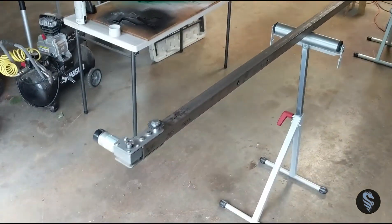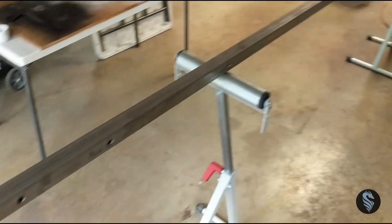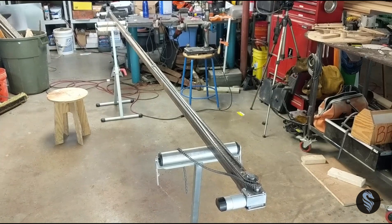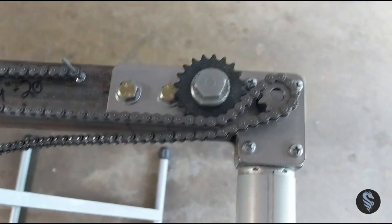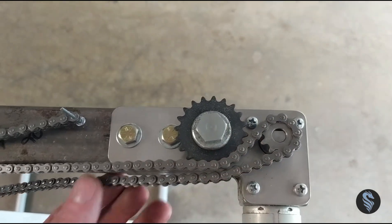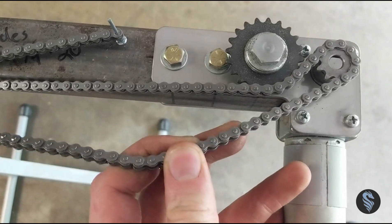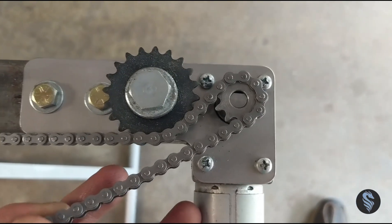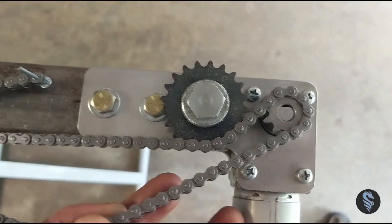We now have a top beam with both motors mounted to it, so the fun part begins — figuring out how to run the chain along the new top beam. This is the one part I haven't really planned all that well, so we're going to see how it goes. I ended up moving the sprocket to the inside bolt to get more engagement around the sprocket, because when this is operating the chain will angle down and give great engagement, allowing the motor to do more work. Eventually I'm going to try larger sprockets in an effort to increase the feed rate of the machine, but for the meantime this is probably good.